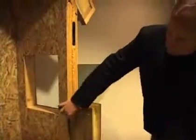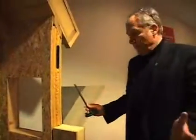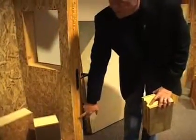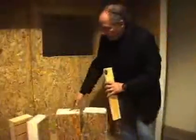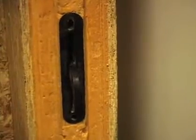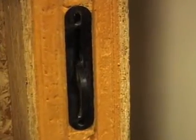We spray foam in this seam and up in this seam, which makes a very, very tight seal. There's one of these cam locks every two feet up the length of the panel. The electric chases are standard in all of our panels at outlet height, and that will be designed according to the floor plan of the house. With the expanded polystyrene panel, we cannot put the cam lock into the foam. The polyurethane panel foam is injected as a liquid and forms around the cam lock.